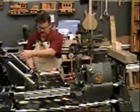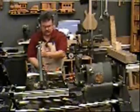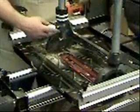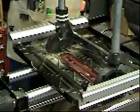If you put the table back in and tighten up the table tilt lock, you're going to be squeezing the trunnions together. Then when you tighten the bolts, the trunnions will be squeezed in against the mounting posts, and it will be very tight. In fact, you'll hear some really loud squeaking when you try to tilt the table.